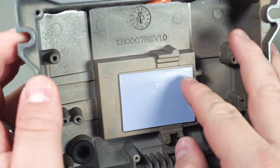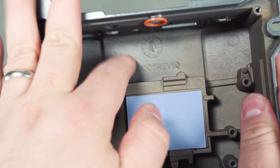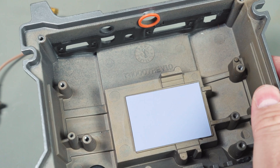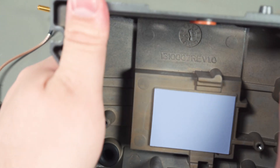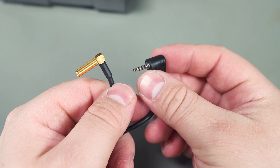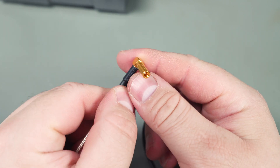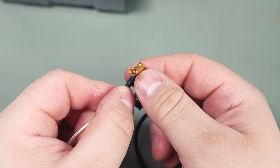It took a little while to get the motherboard out, but eventually I got it. There's a big thermal pad here and a heavy-duty die-cast piece. There's also a little bit of weather sealing along this, so it's obviously designed to be in a rugged environment. The audio connector is a 2.5 millimeter jack, and then there's a funky-looking RF connector that seems like a standard one but it's extra long — I've never actually seen one of these before.